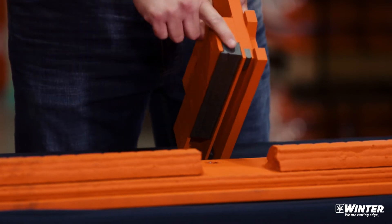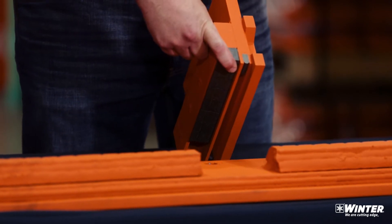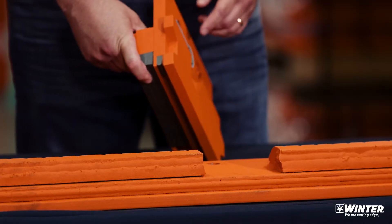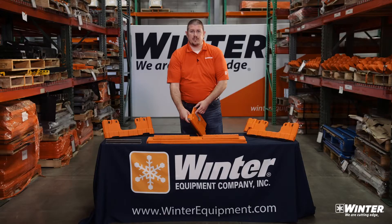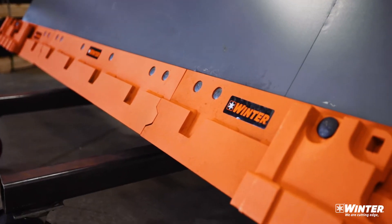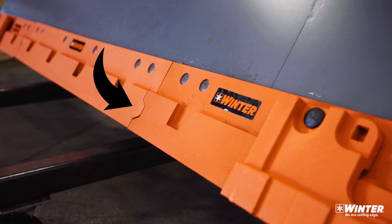The Razor XL has a three-quarter inch by seven inch tall carbide blade that has that bullnose insert in it. On the front, we weld on an AR500 steel cover plate. The AR500 steel cover plate has interlocking tabs, which helps give some rigidity and strength across the entire length of your plow.